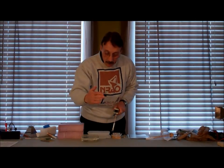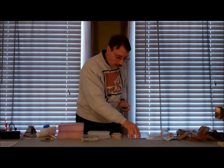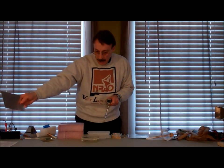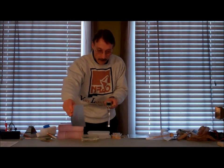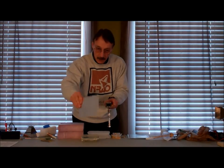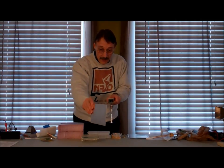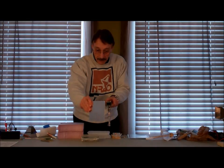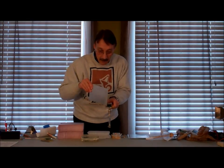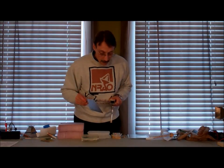Well, I'm not going to keep my hand out there because, believe it or not, you can feel a little bit of heat. And I don't want to expose my hand to that for too long. So, a piece of aluminum, very good reflector for microwaves. And so you can see that angle is about 45 degrees. It bounces here, bounces in, so the angle of reflection and the angle of incidence are equal.